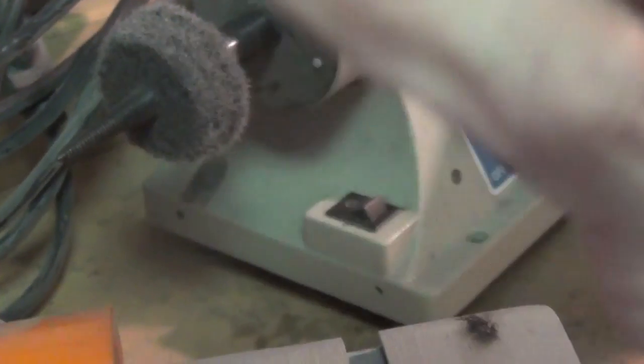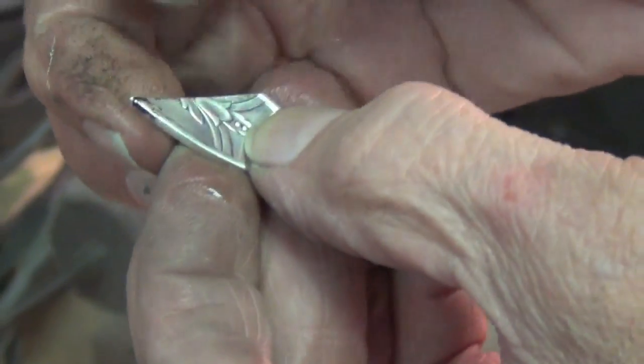All right. There's a little bit of discoloration, and that comes from the heating of those little leather pads. They're going to leave a little bit of discoloration. You're going to be able to sand that off later, so we're not going to be concerned about any discoloration. Sometimes you're going to have a little bit of burring on the edge, and what I do is I'll use the fiber wheel and just hit those edges very lightly. That also makes sure everything is nice and clean.